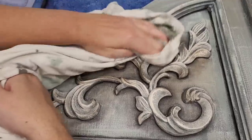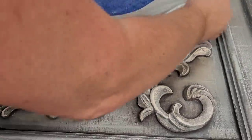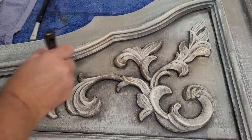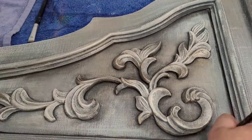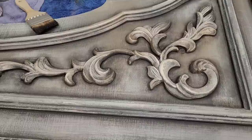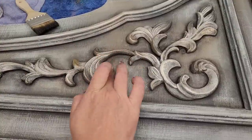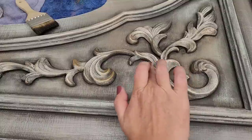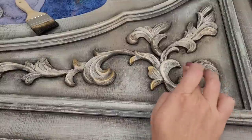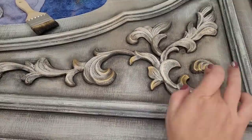To keep that softness, once I've got my wax applied I buff away as much as I possibly can with a dry rag. You can see how removing that wax with the dry rag just really softened the look — it gave it a very dark halo but you can still see the paint underneath. I'll be honest: I'm going to seal this in clear coat, which probably breaks the rules. But it's so little wax left on the surface, just in the crevices, that I use a water-based clear coat with no problem. If you're doing an all-over waxing I definitely don't recommend that, but for just detail waxing I do it all the time.